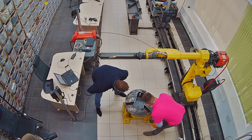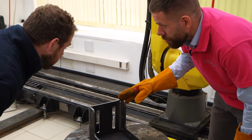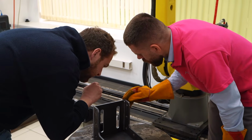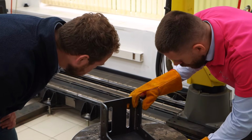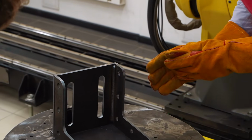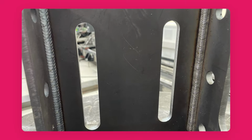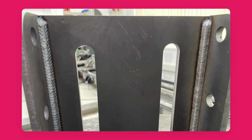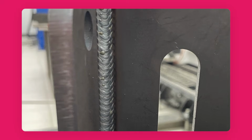This is the welding arc pressure, and this makes the penetration. We may not see it right now, but it is there. And with the weavings, you see a less convex shape. It is because when you move the torch from the left to the right in the special way, more metal occurs on the sides.